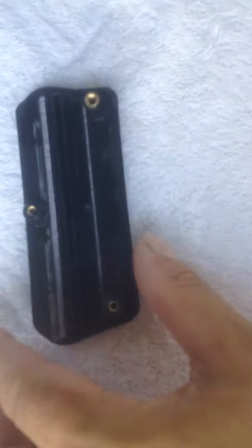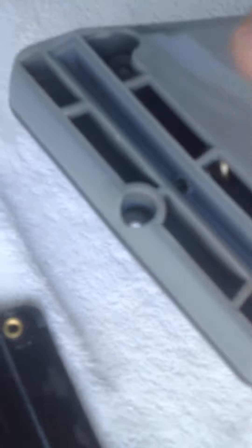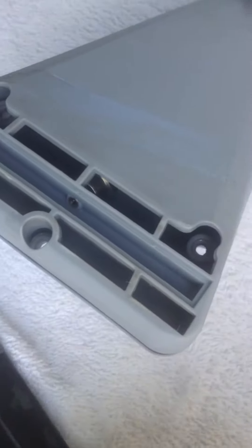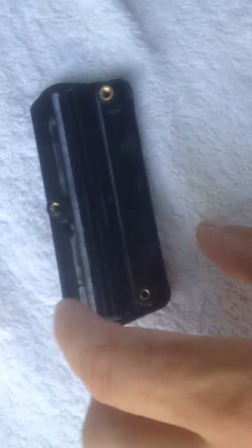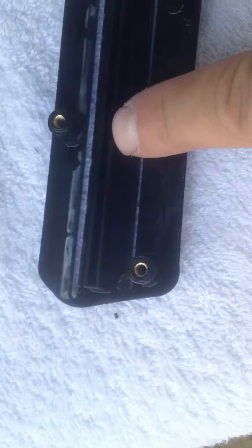This is down to a bit of a design flaw. What we have is a single outlet here, which then feeds into this rail. The rail feeds the holes very much like a watering can. The problem is the jet of water hits the centre and you get more flow in the centre area, which is not what you want.